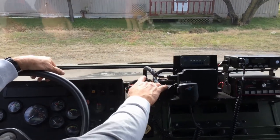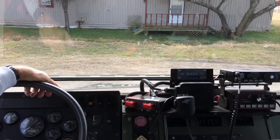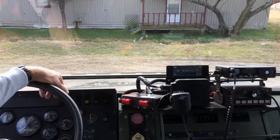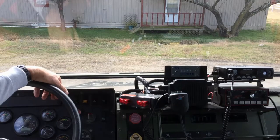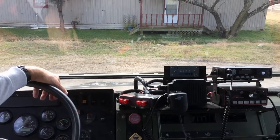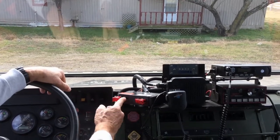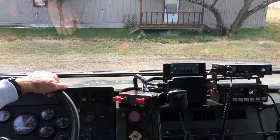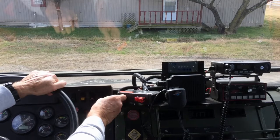The highway and off-road buttons are what we'll probably use most. Up here we have your switch for the PTO. As mentioned at the pump panel, there are two switches for that. The driver must have the truck at idle before flipping on this enable switch — when he does, he turns control over to the pump panel operator, who can then turn on the pump.